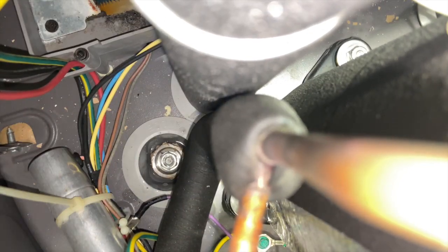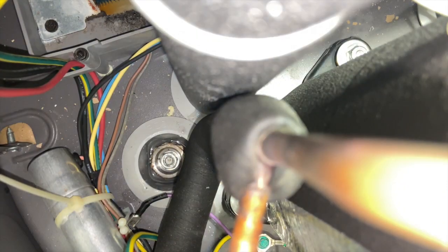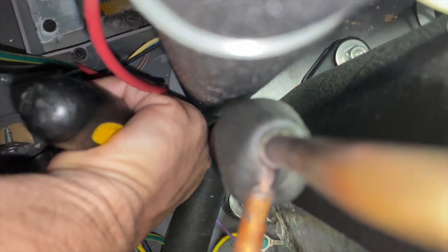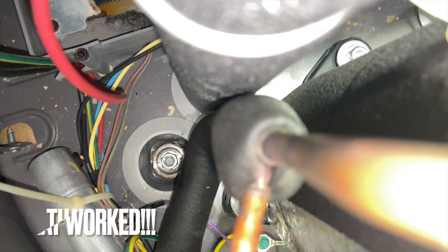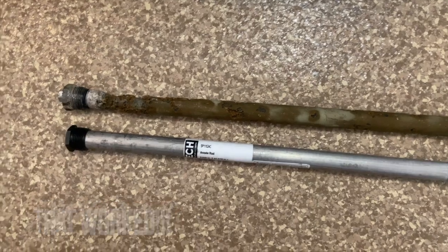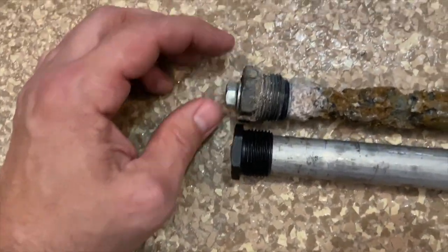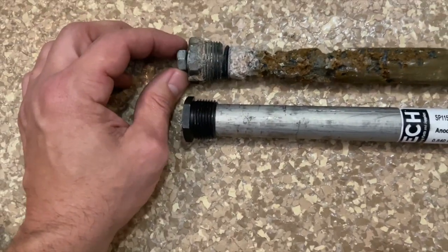If anybody knows a good trick for this part, feel free to drop it in the comments. I'm just kind of knocking it to the side like that, trying to pull up on it. Maybe a screwdriver to pry up would work too — try to come in with a screwdriver on the side and just see if I can pull up on it a little, because I really can't get my finger in there. So I've got the old anode rod out and I've set it next to the new one to do a side-by-side comparison. The biggest difference is the old anode rod has this little attachment with some sort of wire core.